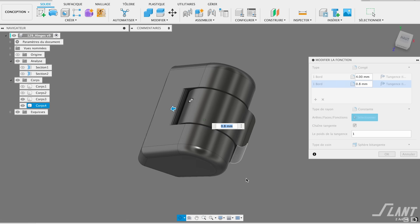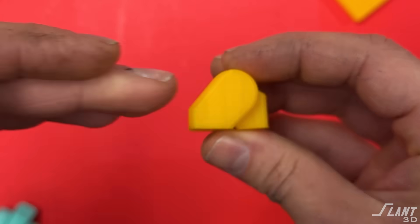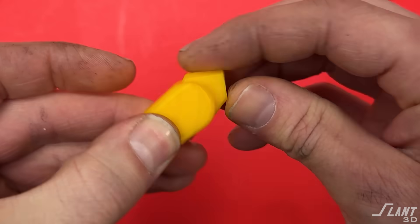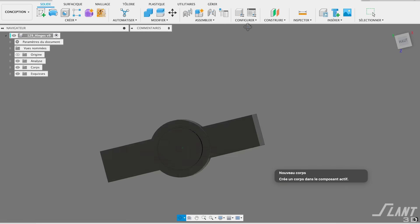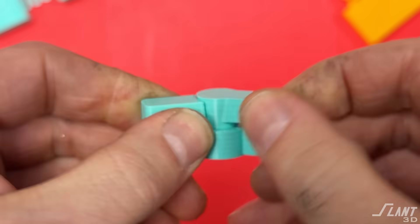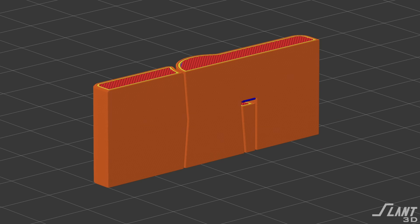When using one of these mechanical hinges just make sure you're making it beefy enough to compensate for the inter-layer adhesion. It doesn't cause a problem — it's just a design style you have to follow. Make sure it's printed horizontally so everything is as strong as possible. But what if you have a box and need to print it up on edge? Now you can use one of the more unique hinges: a cone-shaped hinge. Even though it's level, you can't pull it out of the hole it's inside of, because the inside splays out and is coned — it's all print-in-place but you still have freedom of motion and no side travel.